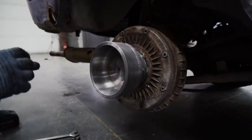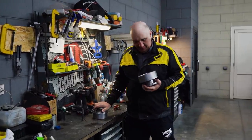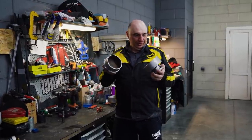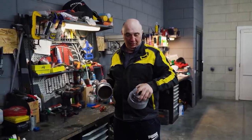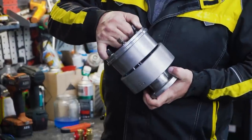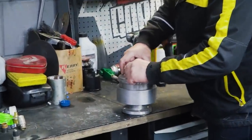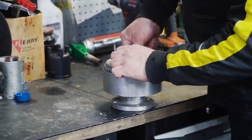Okay, so here is where we're at with this. We've got a couple of these lovely... One of these is a cylinder, the other a makeshift piston thing. As you might have guessed, this part is going to be bolted to the wheel. You'll notice that this flange has the same bolt pattern. As for the counterpart, I mean the piston, that's going to slip into the cylinder. And already, without even any additional seals, it only moves up until you cover the hole, after which it stays put.